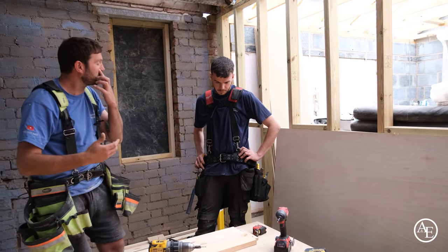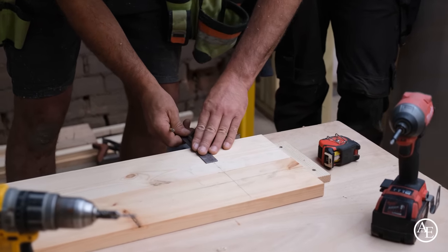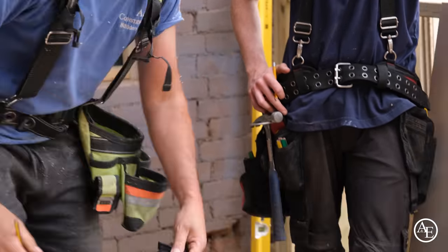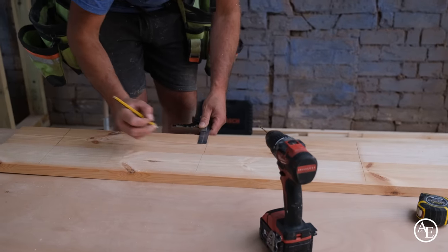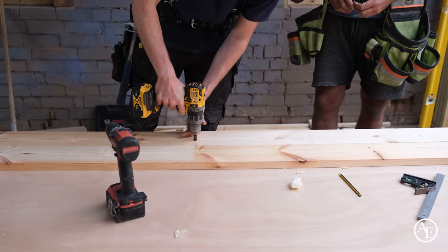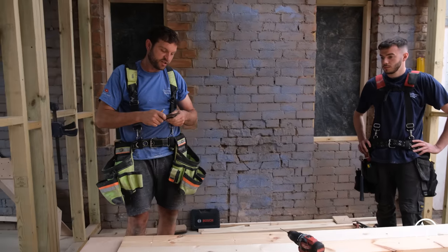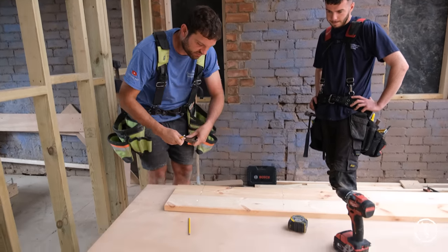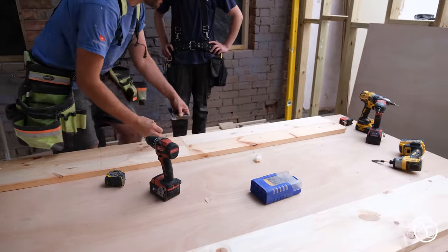Remember that is 10mm back from where your door line is — set it to that. In this instance it's 80.5mm, but I'll set it to 80 for argument's sake. So your first drill is going to be at 80mm, repeated along the frame. For the next set of holes, consider that we've got 15mm make-up of plasterboard and skim from that face, so come in about 30mm — that gives you plenty. Once again, it's all going to be covered by your slamming strip.